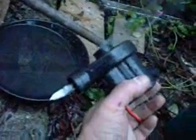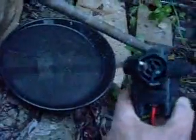What can I say, but where did all the aluminium go? That crucible was full of aluminium. Now it appears I may have busted a hole in the crucible, and I've lost the aluminium out the bottom. Aluminium has come down the feed pipe into the blower and ruined my blower.